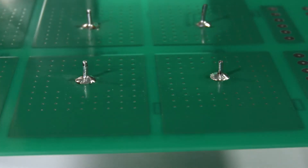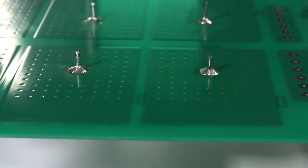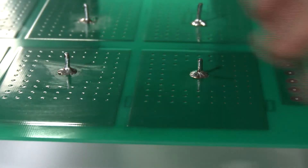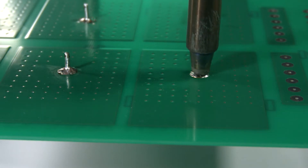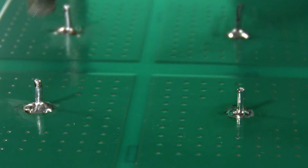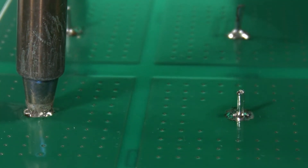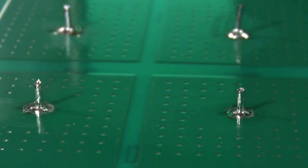The station is set to 750°F. What I'll be desoldering are these large wound coils to simulate those large heavy components — those large inductors. Your standard desoldering tools won't be able to melt this type of component because it absorbs a lot of heat. But as you can see, by using the FR-400, it melts pretty easily. Fast, powerful — and the larger size nozzles really help in reworking those big large components.